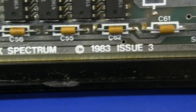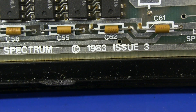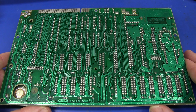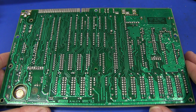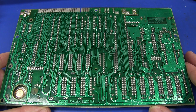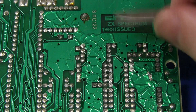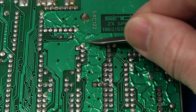And of course they didn't gild the lily on the edge connector - literally. I'm quite surprised that Clive decided to spring for silk screen on this stuff - really pissing away money there, Clive. Copyright 1983, Issue 3. But wait, look at the bottom - we have spared no expense. We've got solder mask! Why you do it on the top and not the bottom I don't really know. But there's the crinkle he's talking about. Let's check it out. And there it is - the famous crinkled ground planes. Very common for the day.